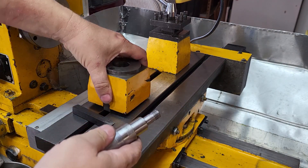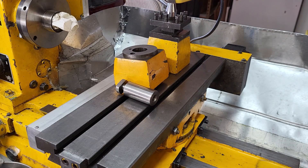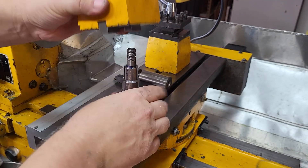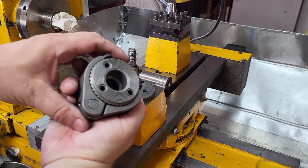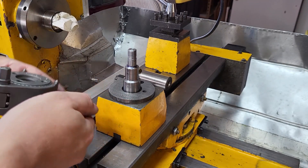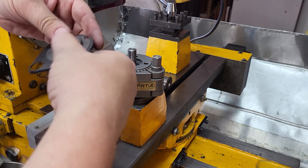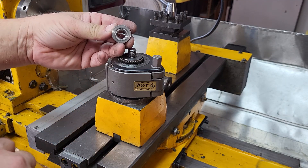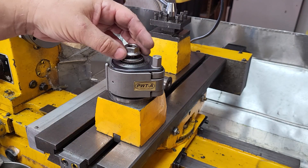For the multi-fix - just to show you - the original ones are suspended on these bolts and have a thing that goes into that to hold it down. For the multi-fix I made up an adapter to use the same cast iron block that was already there. The three diameters: one fits the existing diameter, and the tool post has two diameters that I machined to fit, then it goes on like that with a washer. We have a half-inch flange nut on top with knurls, originally knurled on the bottom, polished off to give a nice connection for the multi-fix, which works wonderfully.